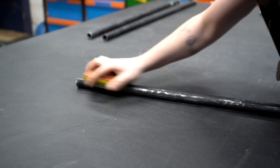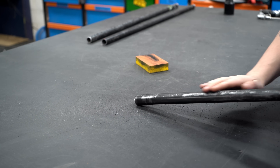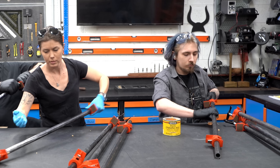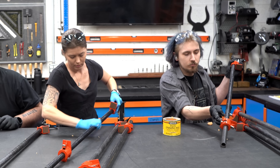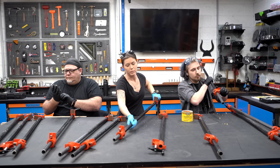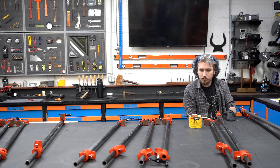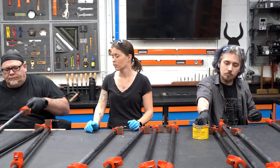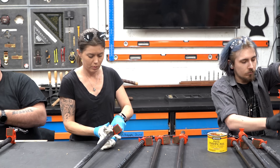When it comes to pipe clamps, you have a couple of options for pipe: a galvanized option, which is a bit more expensive, and black pipe, like we're using. I prefer the black pipe. It's a little more work on the front end — we like to sand off a lot of that black finish or at least smooth it out. Then to keep it from putting black marks on our glue-ups, which is pretty typical especially in high-tannin woods, we just wax them with any furniture paste wax. If we do end up getting black marks because the wax wore off, I just use oxalic acid and that takes the black mark right off the project. Sand them and a little wax and you're good to go.